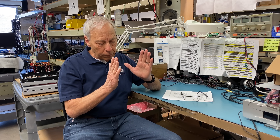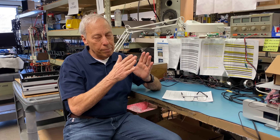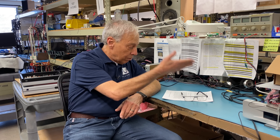Why? Because pulse density modulation is such that we have all these bits coming out at a very high rate — five megahertz, five million times a second — you have these bits coming out. If there's no sound, we get no bits. When we do have sound and it's very low, we get a couple of bits, and if it's loud, we get a whole bunch of bits — a higher density of digital bits. Now bits are just energy turning on and off, and if we just use a capacitor, just a low-pass filter at the output, we can roll off those transitions and what comes out is analog. That's why DSD is so perfect for an FPGA, and that's how we do it.